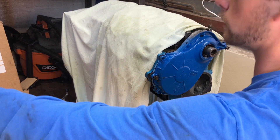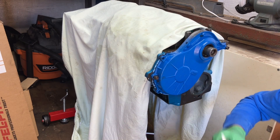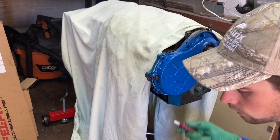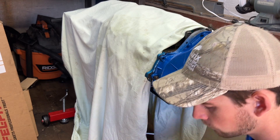Okay, this is all aligned now. The bolts are going to have to come in and out a bit. I'm going to Loctite these just because I know the threads. I tried to clean the bolts well, but they do still have a bit of oil on them. I struggle with these bolts coming loose on occasion — I'm just using blue Loctite so it's not permanent.